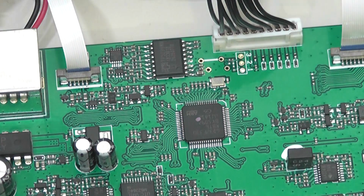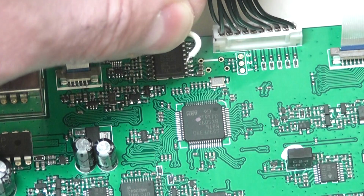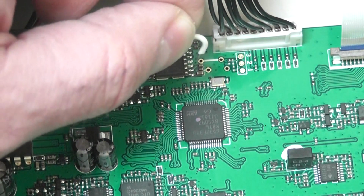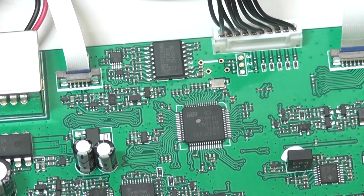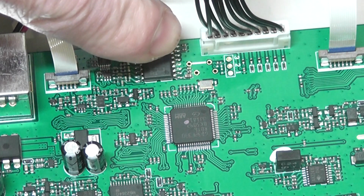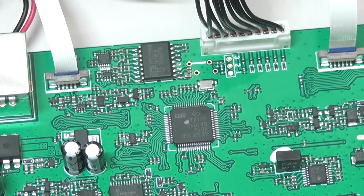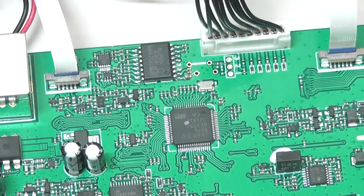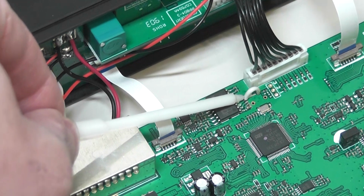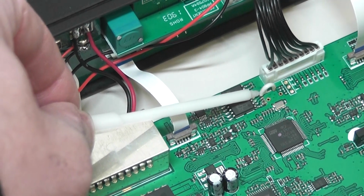So you would have to basically use a really small little piece of wire. I'll kind of show you an example. Helps if it has a solid core on the wire, and you would stick that into one hole, stick it in the other side, and you could solder it through on the other side. Now again, just to give you guys perspective on that, that's my finger, and that's how big that is. So we're dealing with some pretty small stuff. If you're not comfortable soldering that, you may need to take it to a technician who can do it for you. This might be a little tough to see, but there's now a white wire. I'm now pointing at the white wire that I soldered in to connect those 2 points. So I'll show you what you do next.